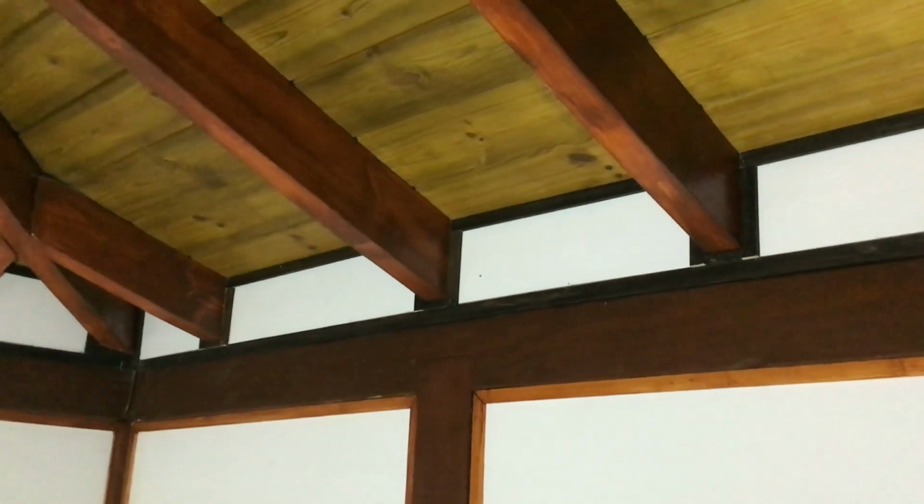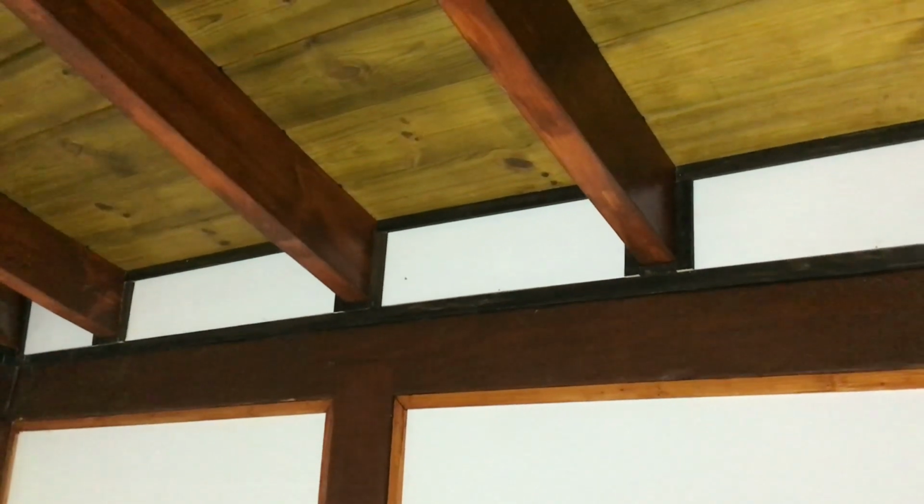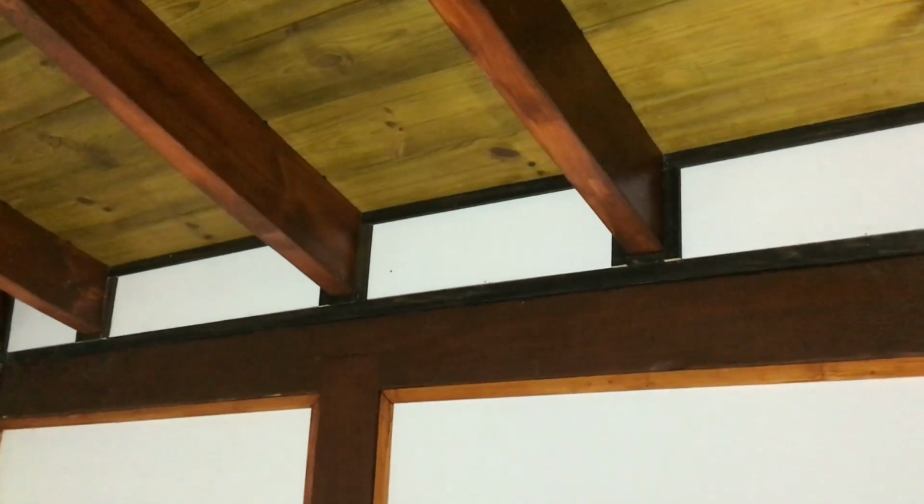So to make the fascia door, what I did, as I've said before, was to use plywood. I cut that to shape, and then I framed it with 18 times 6mm strip wood. There we are, and all that I did was paint it to the appropriate colour. On the outside I painted it a dark, rich mahogany, and on the inside ebony.